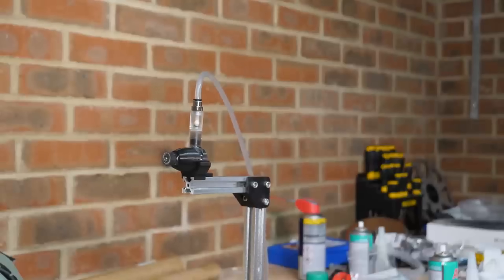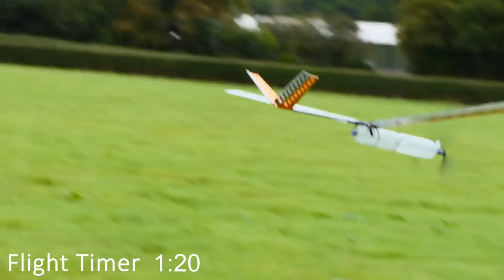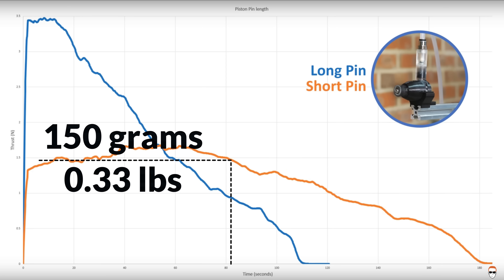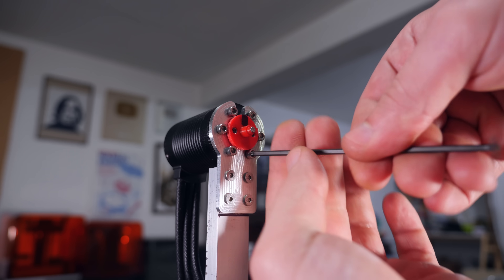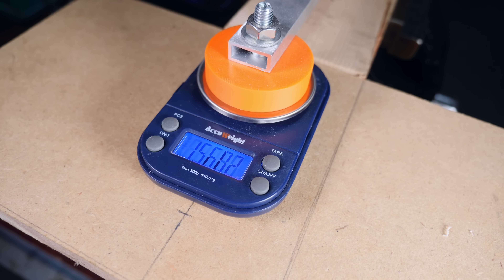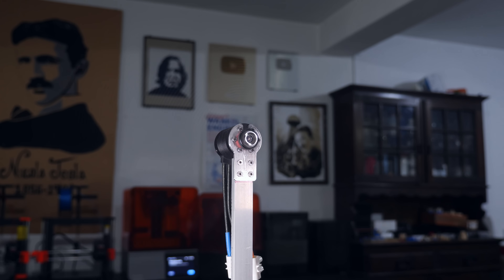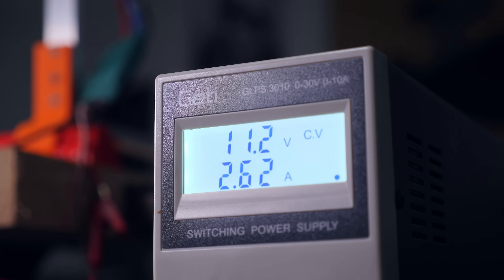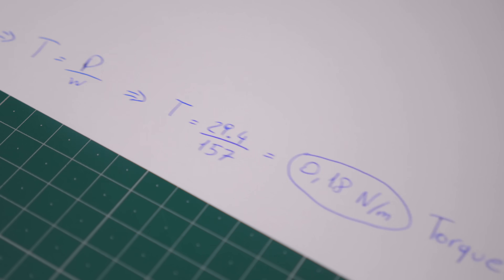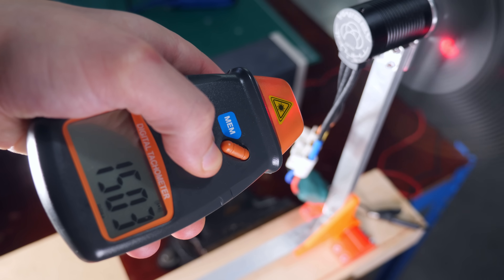I noticed that in Tom's bench test he always gets a runtime above one and a half minutes, but in his actual flight the plane was in the air for only 1 minute 22 seconds, which means the minimum thrust necessary is about 150 grams. I hooked up an electric motor to my test stand to rotate the propeller up to the speed that gives me 150 grams of thrust — that speed is about 1500 RPM. By reading voltage and current and multiplying them together, I get the electrical power being used, and I can use that to calculate the torque necessary to reach 1500 RPM.